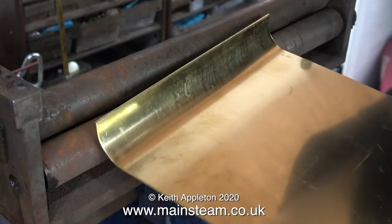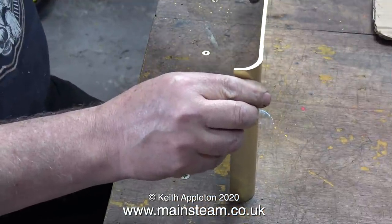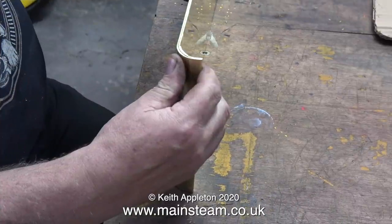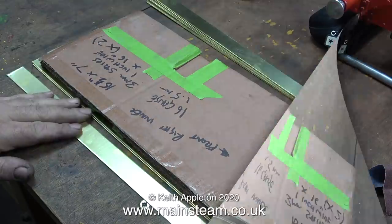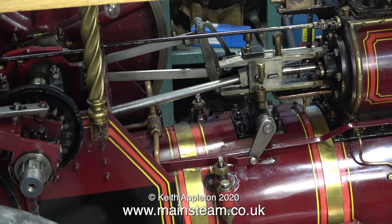Like any other job in the workshop, you need to practice to do this correctly. Here's the result when I bent both of them and put them together — the bends are identical, well near enough anyway. The bends are perfectly square to the brass sheet; if you put the brass sheet in crooked the bends are not too good. The narrow strips of brass that came in the parcel are going to be soft soldered to the top and bottom of these side protectors.